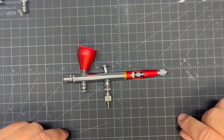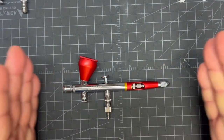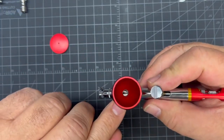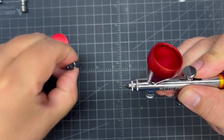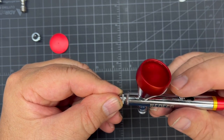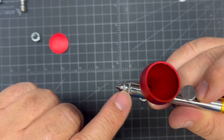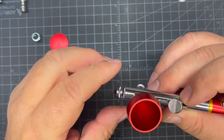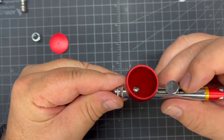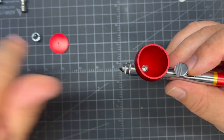I'll start by taking the cup off. I'll tear it down to where I do my normal cleaning, and then to where I do my major cleaning. For normal cleaning, we'd take the cap off, put cleaner in, take off the nozzle protector, put a finger over the top lightly, push down and pull back — that back-flushes it and pushes air backwards. I'd wipe it out, run cleaner through it, and blow backwards to break everything up.